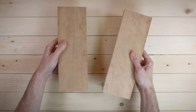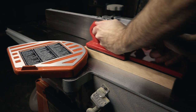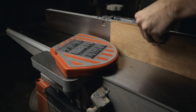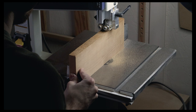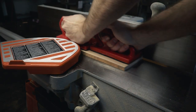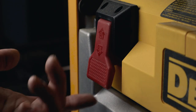After getting our stock down to a few more reasonably sized pieces, it's off to our customary starting point. In order to get our stock as thin and paper-like as possible, we're going to use a technique called resawing. We do this by surfacing a couple of faces on the jointer, and then swapping over to the bandsaw to cut our pieces vertically right down the middle. Once the pieces are nice and thin, it's back to the jointer to clean up a face, then the planer to thickness, and repeat.